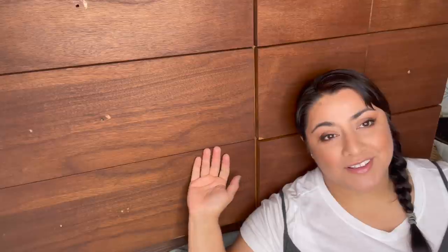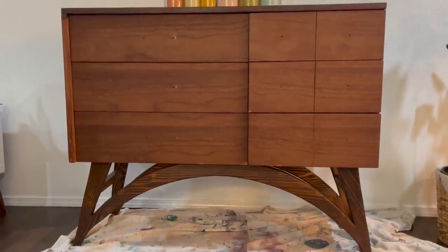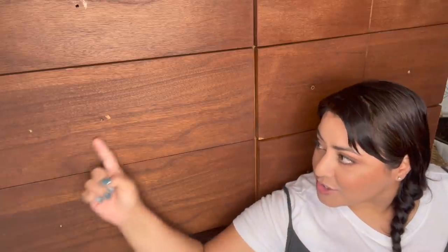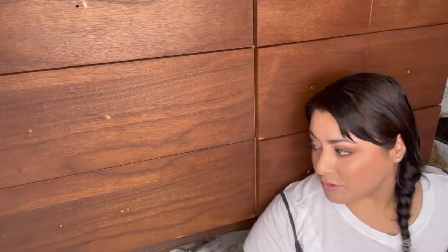I've had a little change of heart about this piece. I know I went through all that trouble of staining it and bringing out all this beautiful wood grain, but stepping back and looking at the entire piece, it's just way too much wood for my liking, so I'm going to paint it. The big kicker was all of these little dings that I had to wood fill — I was going to very carefully with an artist brush paint them all to match the wood grain, which is doable but would take a lot of work. But even so, stepping back and looking at the overall piece, it's just way too much wood. So it's going to get painted. I'm not going to cover the entire piece in paint — we're still going to have some of this beautiful wood showing through.